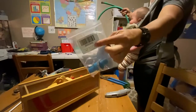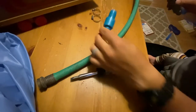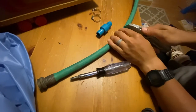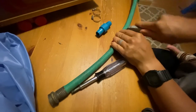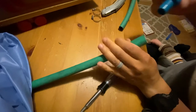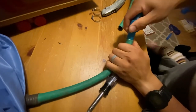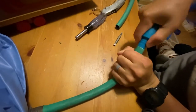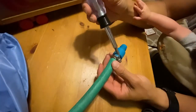This is the actual check valve you get on Amazon, and in my other hand I just have a regular garden hose. What you're going to want to do is cut your garden hose in half, or just cut it in a certain section. Then you're going to put the check valve in between — it has a barbed fitting that you press in there. It was a really tight fit. I think it depends on what hose diameter you have. Hoses come in two standard diameters. If I had a bigger three-quarter inch one it would have fit better, but this worked too.